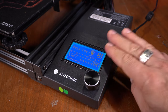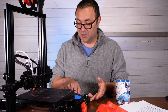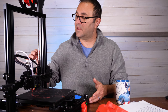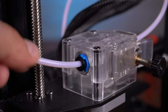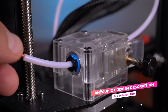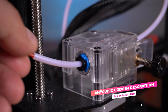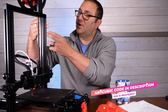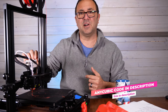I also love the slim form factor of the power box — it's nice and low, maybe two inches high and six inches long, really a nice form factor. I also really like the extruder — it's sort of like a Titan style. One thing I love about it is the PTFE tube in the back. If you've got an Ender where your filament is mounted up top and goes into the extruder, it can pull up and groove into the extruder — that happened to me on my Ender until I switched to an all-metal. This tubing solves that and it's a really nice touch.